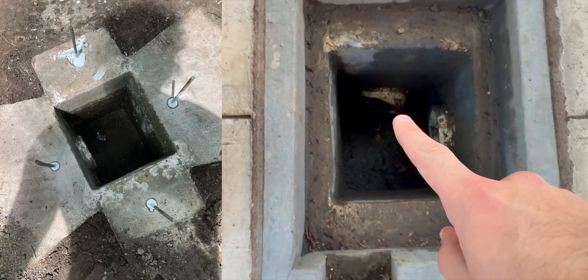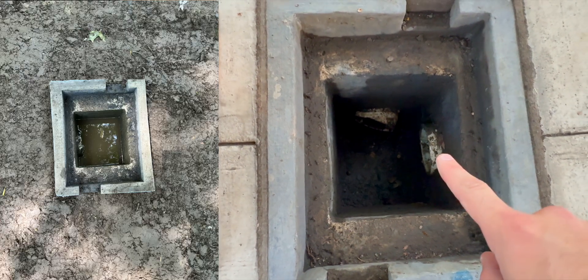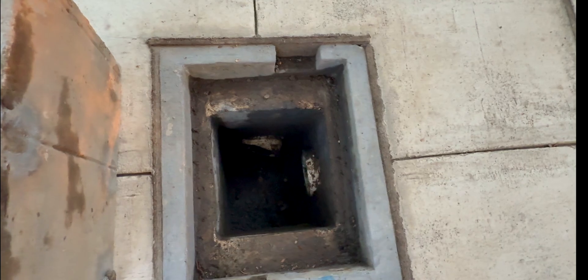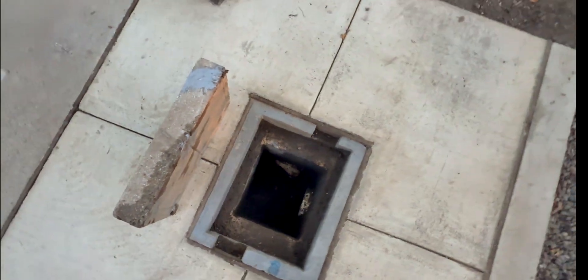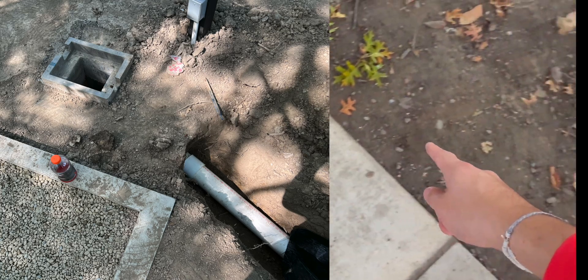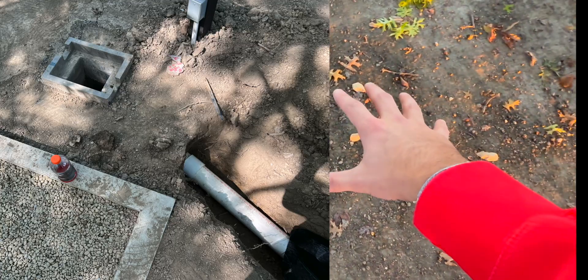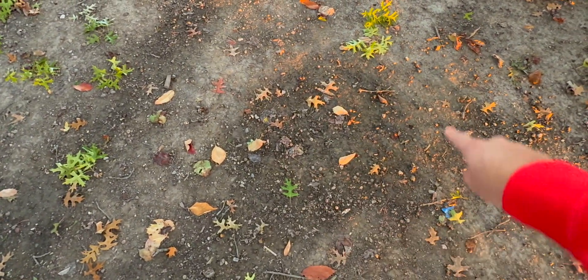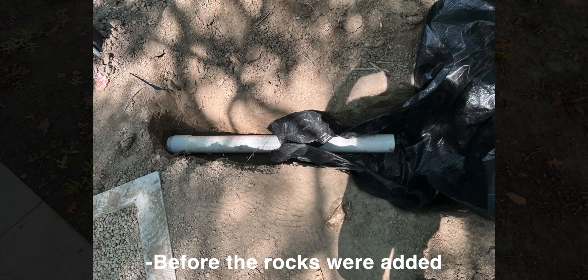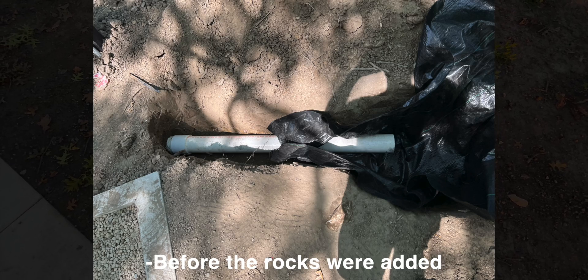In the beginning I did not have that outlet pipe right there. I only had this pipe and there were issues with water coming above the concrete and flooding out. So I decided to add another outlet pipe that leads over here to a dry well. You can kind of see the outline because most of the water goes to it, and this dry well worked really well because we've had a lot of rain and no flooding.